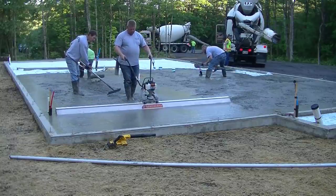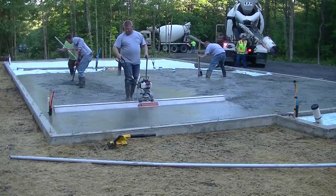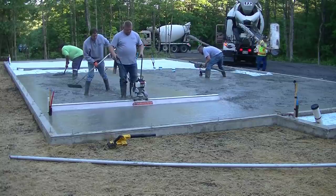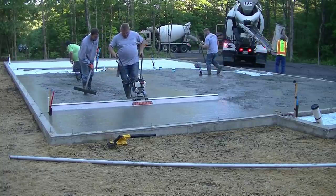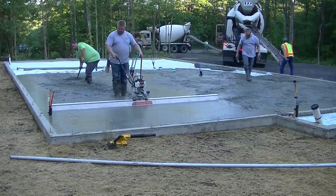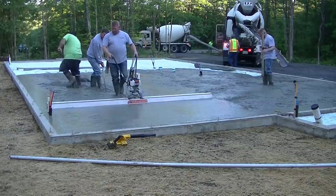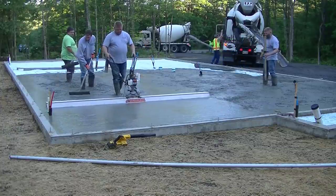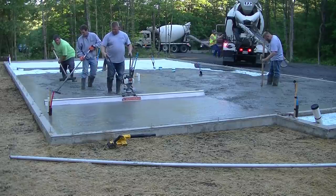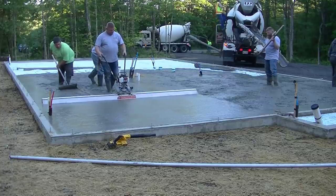He's just making sure his footprints are full when he picks his feet up and moves them back. You can see how easy it is to screed that concrete. He's watching both ends to make sure he's leaving a little bit of a line — meaning both ends are touching the pad, not riding up high and not digging in deep, going at a nice slow pace.